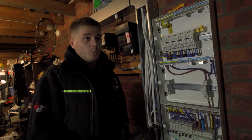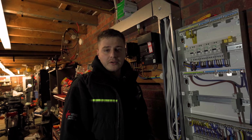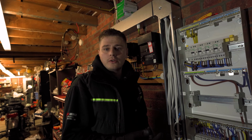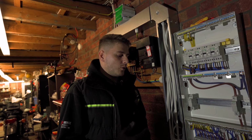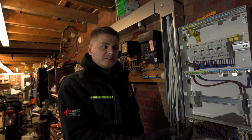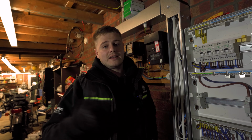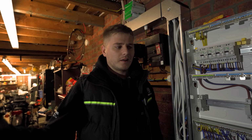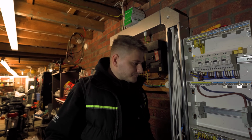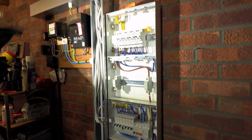The other thing is the wiring in this place is horrendous. You've got lights coming off the cooker circuits and all sorts, so I might need to chuck a couple of new feeds in basically and sort that out, because there's like 2 main lofts and some of the circuits go down one loft, some of the circuits go down the other. So the DIY hero who had the house before, instead of running in a new lighting circuit, you come off the cooker circuit and stuff. So I've got loads of space in the middle here basically to run things in, but I'm actually really happy with it. It's really neating the whole thing up.